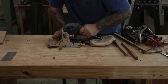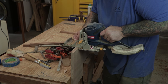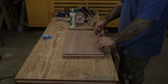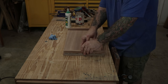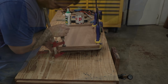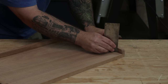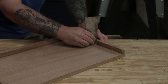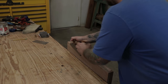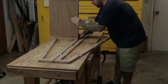The lips on the shelves will be held together with just glue, so I'm using biscuit joinery to keep everything aligned while I apply clamps and get everything glued up. Once I've got all the slots cut for the biscuits and I do a quick test fit, I'm ready to start gluing this up. I think I used just about every clamp I own to get all three shelves clamped up. I paid a lot of attention to the glue squeeze out, trying to clean up as much as I could as I went. Despite my best efforts, I still had a lot of scraping to do when everything was cured. After cleaning up all the glue squeeze out on the inside, I took my hand plane and went around the outside of each shelf. Once the shelves are all cleaned up and squared up, I'm ready to start gluing up the whole assembly.